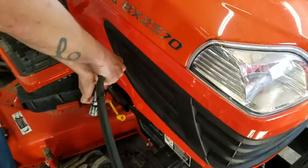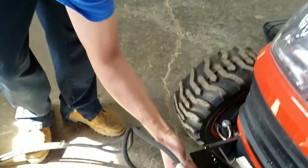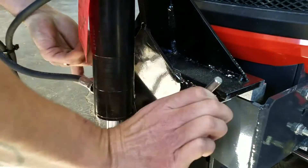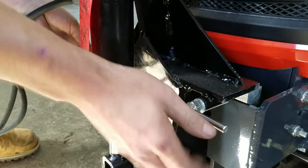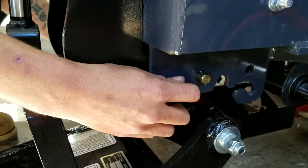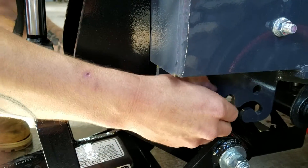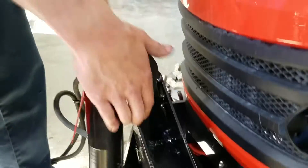Again, you're going to take your couplers off. On this one we've got these turnbuckles — to make it faster we'll do both at the same time, unscrew these. You don't have to do them all the way but you've got to do them a good bit. And you've got these two pins — there are linchpins on the other side — so you'll take them off right like that.